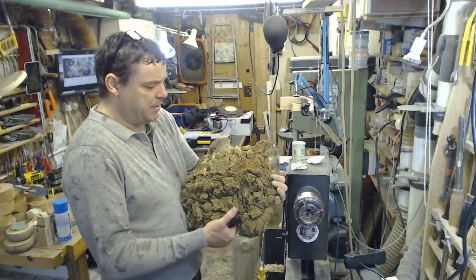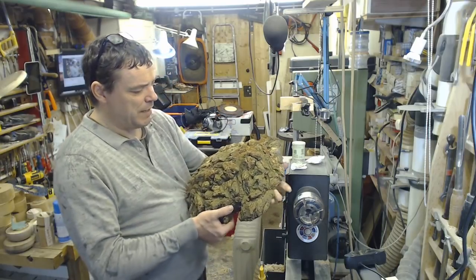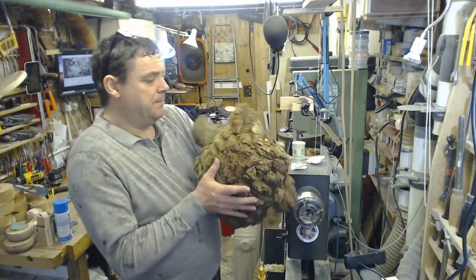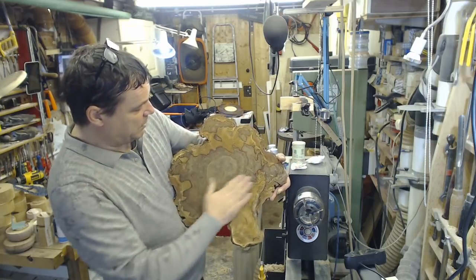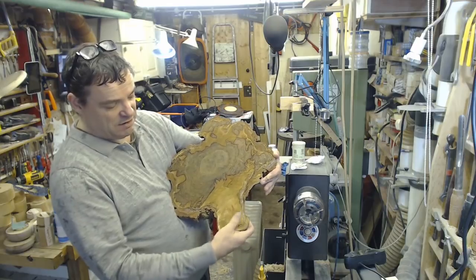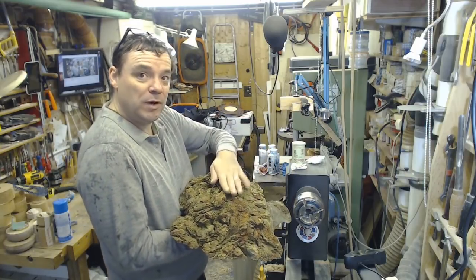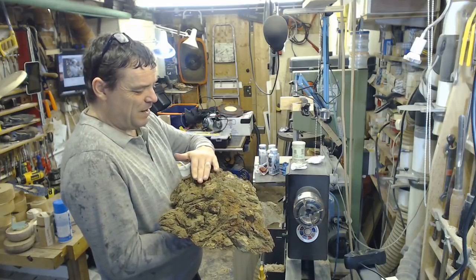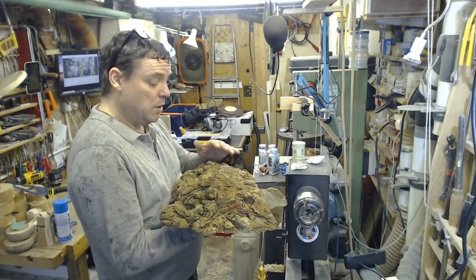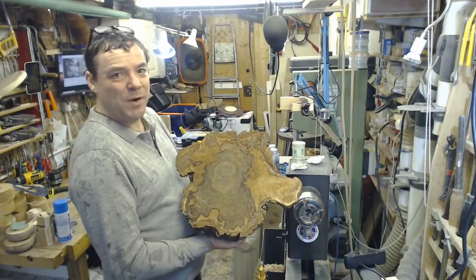It's got very thick bark. Normally I'd be tempted to make this the top, but the bark is really very thick and I'm not sure that would look well on a thin rim. The inside has wonderful dark wood in the centre. I'm thinking of making this the top, keeping a natural edge — even this rather large lumpy bit out here — turning a bowl in the middle and just giving myself an area for standing on a foot, either by taking some of the bark away and standing it on the exposed wood or making a separate foot for it to sit on. I think that'd be quite an attractive bowl top.